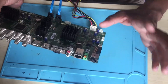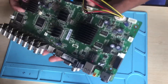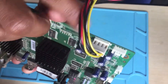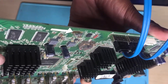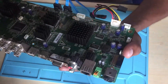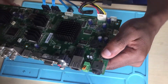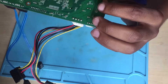I did check the connector here — 12 volts was okay. But the problem is here. When we are doing a physical inspection — I'm not sure if you can see — okay, let's show you. What are those? These are electrolytic capacitors and they are damaged. As you can see, the top part is no longer flat.